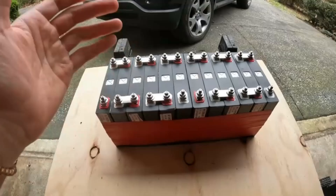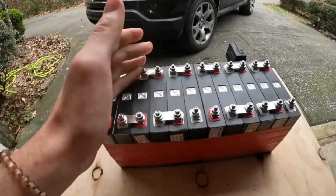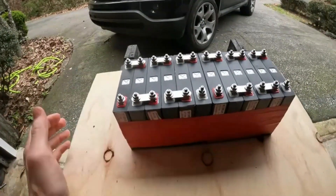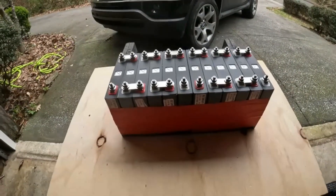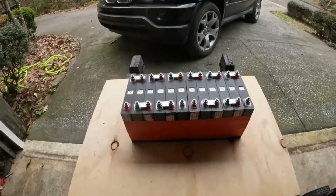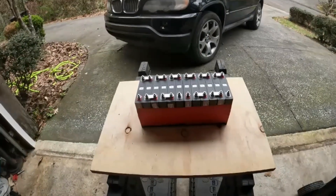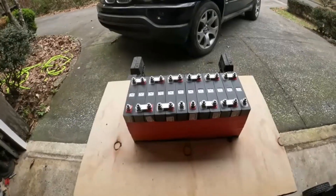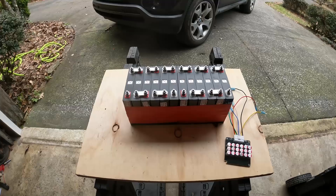The reason why I went with LTO batteries is because of their car audio performance. These batteries can do very, very well in car audio — they can discharge at a very high C rating and they can also recharge very quickly. If you want to know how to make one of these, there are a couple videos on YouTube that I've watched — I'll leave links in the description. Go check those channels out, it really helped me.